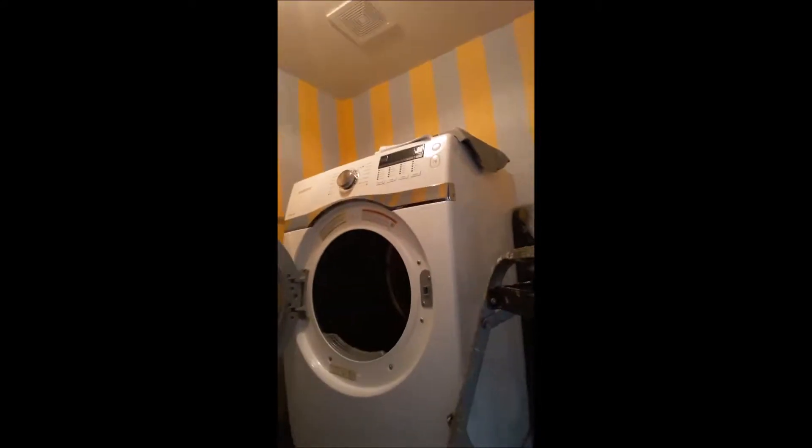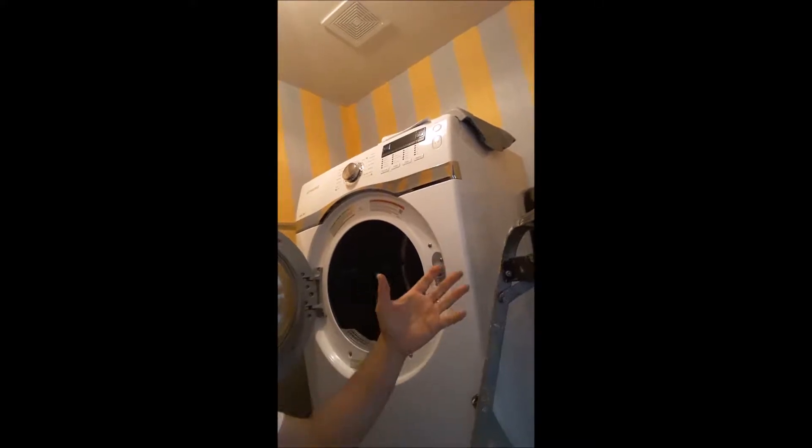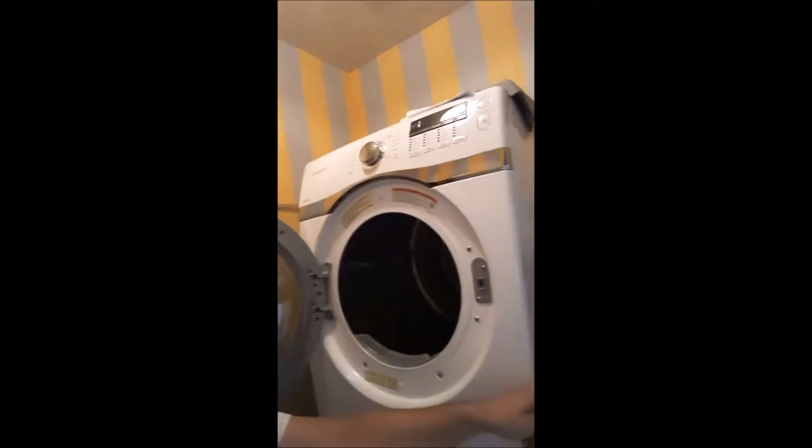Today I am installing a fresh air intake. Behind me is the laundry room. What happens here is the drying machine sucks in so much air that it creates negative pressure, pulling air through the house. We're in a totally sealed space — no windows, no air coming in. The makeup air for this fan is around 100 cubic feet per minute or more; this is a very powerful dryer.